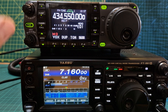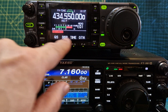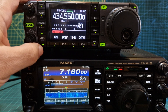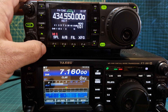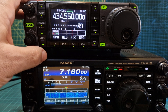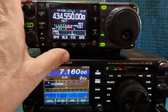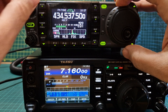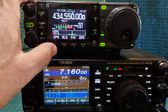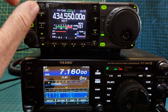There's someone talking there. The menu structure is: push this button for quick all-settings menu — there are quite a few settings. Then you've got the master menus M1, M2, M3. Hold it again and you go into SWR scope and band scope. Click, hold, then you can go right and left and select activity — it's very usable, like the 756.